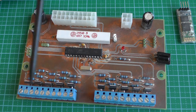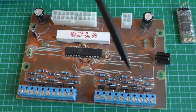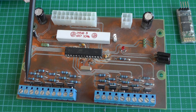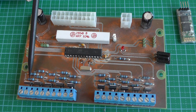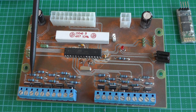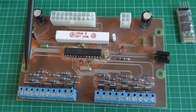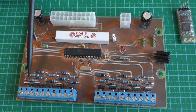The binding posts are the channel outputs — five channels on the left and five on the right, giving 10 channels total to control 10 LED strips. Each channel has one N-channel power MOSFET and two resistors: one pull-down resistor at the gate so LEDs are off by default at startup, and one resistor between the microcontroller output pin and the gate as a ring-back protection when switching high currents rapidly.